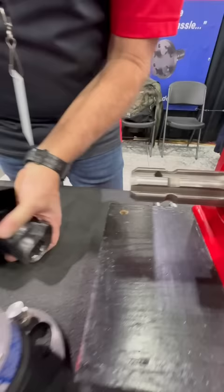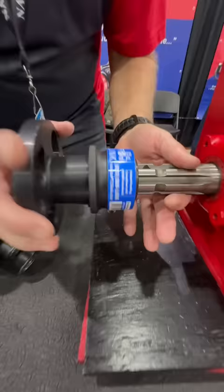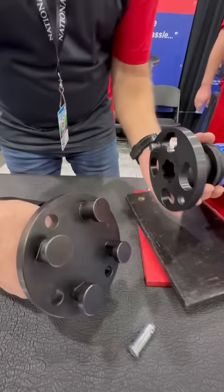We have two interlocking plates we install first on our tractor. That gets locked in easily. Then we go to the implement side, lock that together — the four studs go together. Give it a little half-inch twist, and finish it off with our safety bolt.